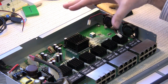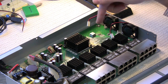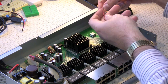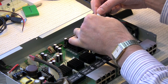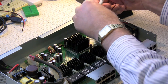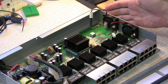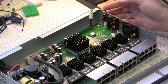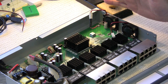This is the fan connection — the switch is now powered up. You wouldn't know it because none of the indicator LEDs are connected and the fans are disconnected, but it's actually live right now. I take the little jumper cable I've just made, plug it in series with the fan, plug the other end into the fan socket, and the fan starts up. I doubt you can hear it, but it's now blowing — I can feel it on my hand — so there should be a reasonable amount of airflow coming through the case.